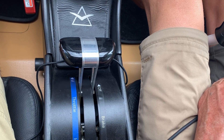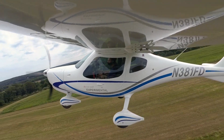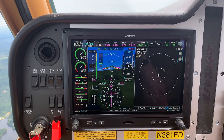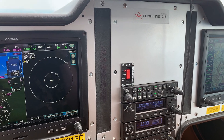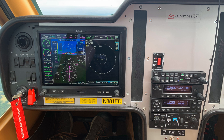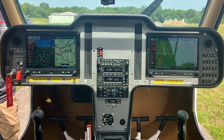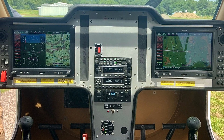The real benefit of that range is you can fly to a reasonable destination with two people on board and not have to buy fuel to get home. Something very different in the F-2 compared to other Flight Design airplanes is the avionics suite — switching from Dynon to the Garmin G3X Touch, dual screen, and a traditional center stack of radios. On the CT series, we had a lot of remote units, but since this airplane is going to be certified with EASA CS-23 and eventually with the FAA, they don't allow remote systems to go through an uncertified screen.